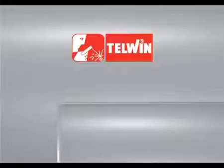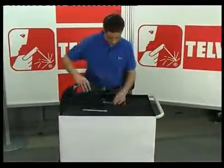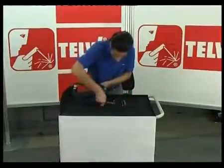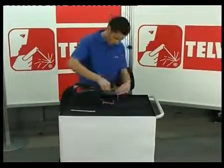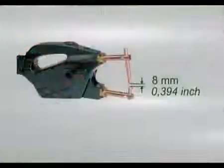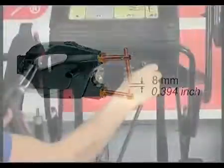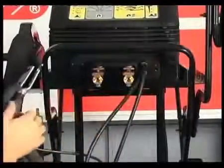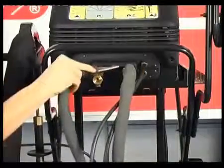Tooling the clamp. Follow the instructions in the handbook to fit the clamp with the supplied arms and electrodes. Center the electrodes and respect the recommended distances. Connect the various clamp cables to the machine. Connect the compressor air supply at 6 bar and switch on the machine.